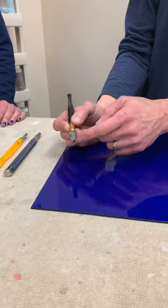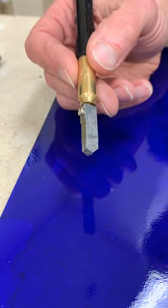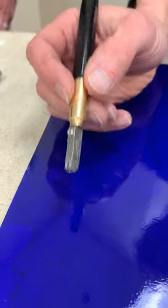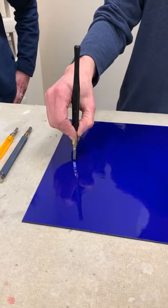There's a small little wheel on the end of this — I know it's kind of hard to see. It's like a pizza wheel on a pizza cutter. It's gonna roll across the glass and that's gonna put a scratch in the glass that we call a score. So I'm putting a score on the glass, and that's easier to do if the cutter is up a bit like this, so the wheel can roll freely on the glass.